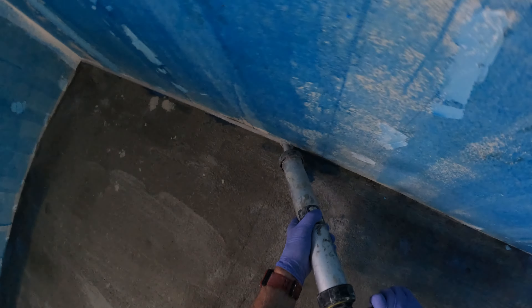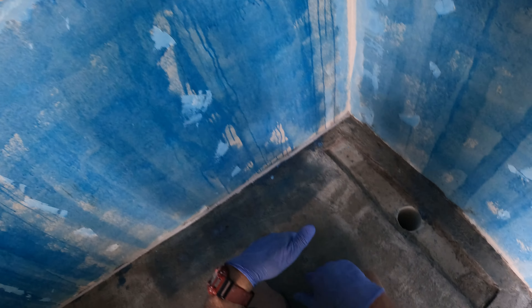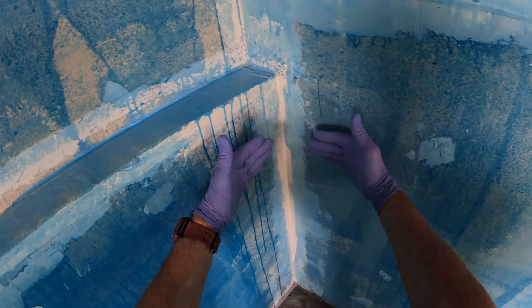I call it bogging up — out there it's called bond breaker. Get the pop in. The reason for this, everyone, is when your wall moves relative to your floor it stretches. If you've got nothing there, because walls always move relative to a floor, or two walls like that will move — that's why you silicon up when you're tiling, that's why you silicon up when you're waterproofing.